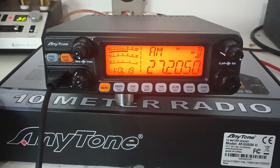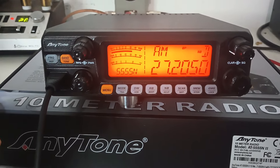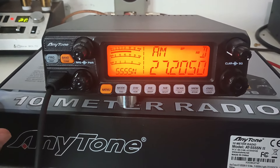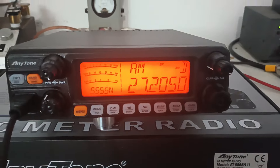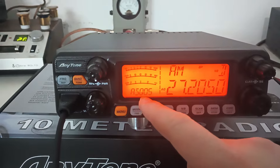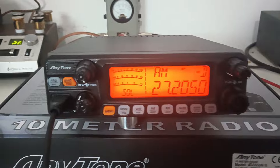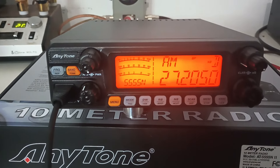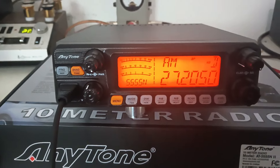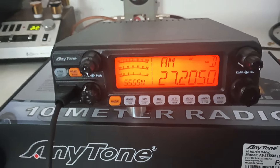We'll test the receive first. You can see it receiving. These things have a super quiet receive on them. There's been people that have gotten these and thought there was something wrong with the radio because they don't pick up any static. Additionally, if you turn your squelch down too far, you'll see that ASQ come in and then you'll have like no receive — or it'll make it even more quiet. So keep in mind, if you turn the squelch all the way to the left like so many of us do on other radios, that ASQ will kick in.